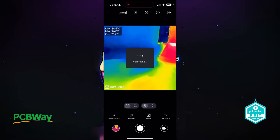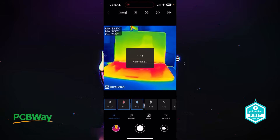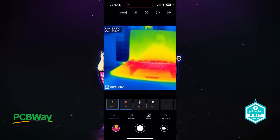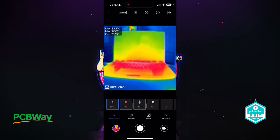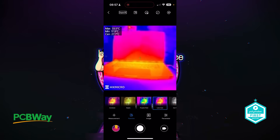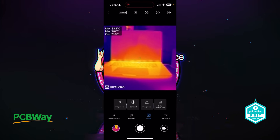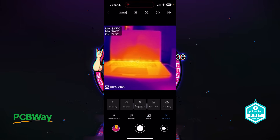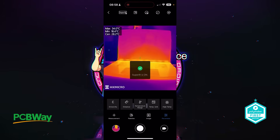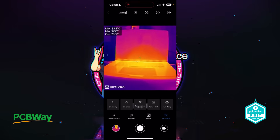I'm testing this on an iPhone 16 Pro, but it's usually the software that needs to be top-notch for a great user experience. In settings you can configure emissivity, distance, temperature range, and units in Celsius, Fahrenheit, or Kelvin. You can activate hot and cold spot detection, select a center point, custom spots, or a line and rectangular zone. The palette option lets you customize colors. Under the image tab you have brightness, contrast, sharpness, and color distribution. You can set manual or automatic temperature range, enable super IR, rotate images, and configure calibration. In automatic mode the system recalibrates periodically — you'll hear the shutter when it adjusts.